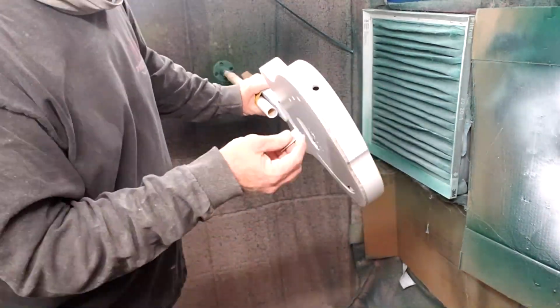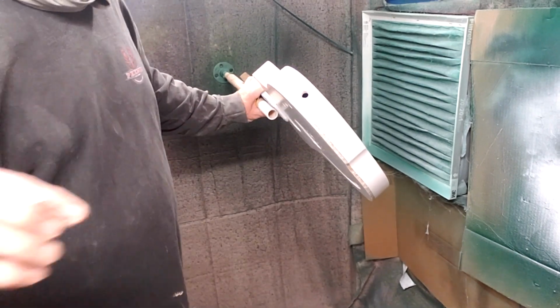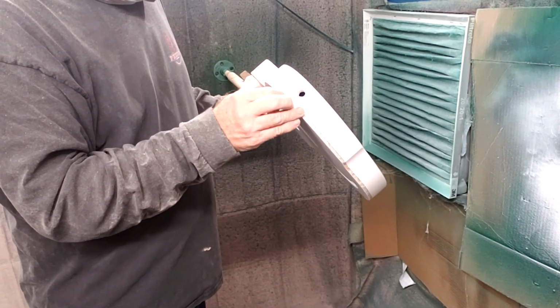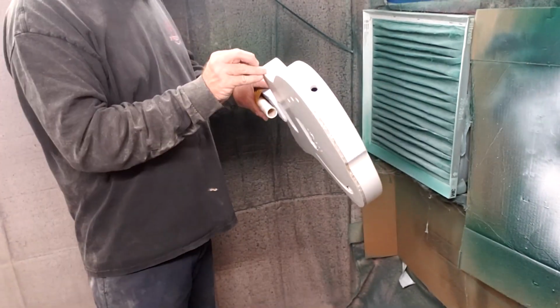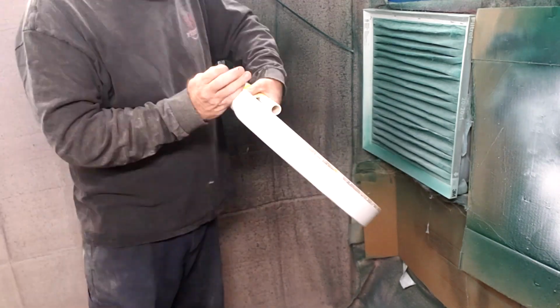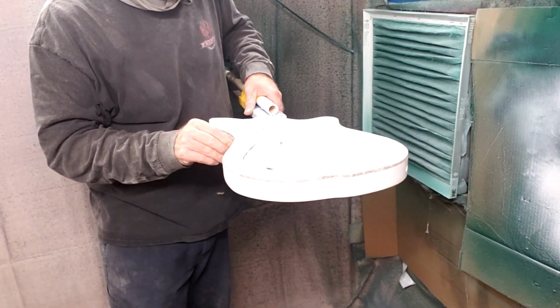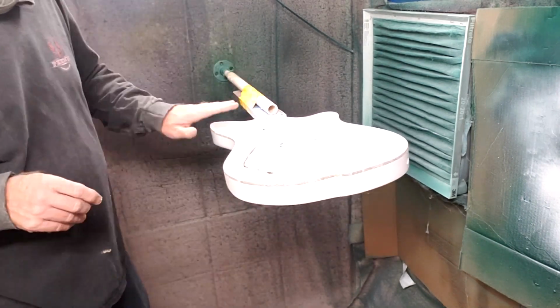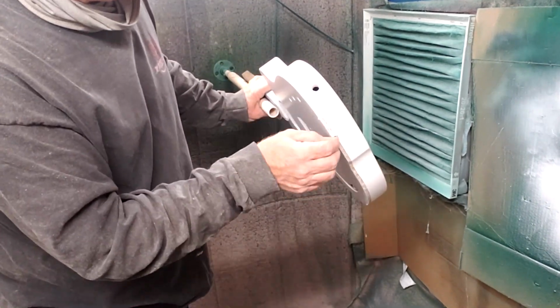Now that's the last coat of primer there. It's only been on for 20, maybe 30 minutes while I took care of those inlays. So that's the good thing, because you see I'm taking the tape off. You want to take the tape off while that paint or primer is still kind of soft. That way you can smooth it. See how I'm smoothing it down with the razor blade.